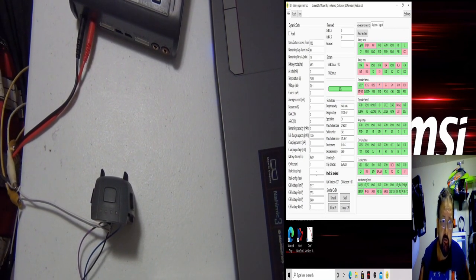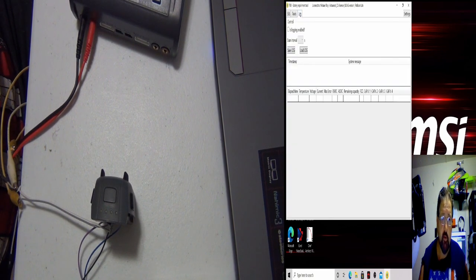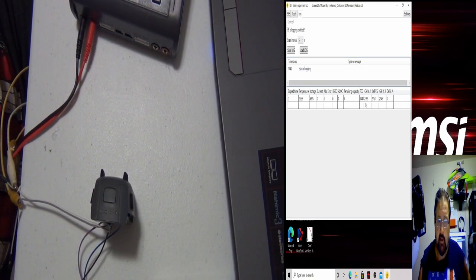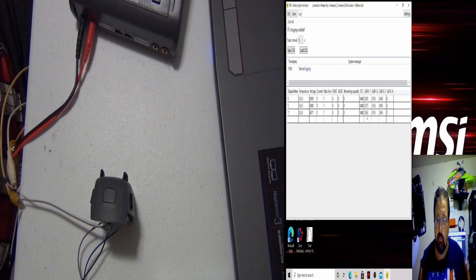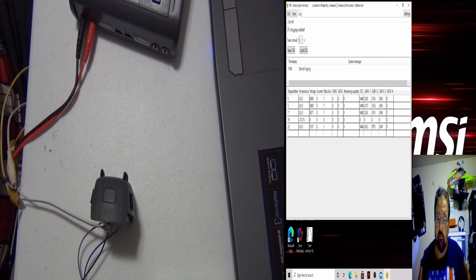So we're still drawing in some voltage here. Let's open up the log. Let's do some intervals of 5 seconds. Let's hit logging the battery. All right, look at the cell count. We got 2300, 2700, and 2900. The problem was the 2373. And we'll keep an eye on this to see if you notice it starts going up and down. Don't be afraid of that because it's bringing one up as it brings the other down. But if you see it not doing anything, check your connections on the battery.